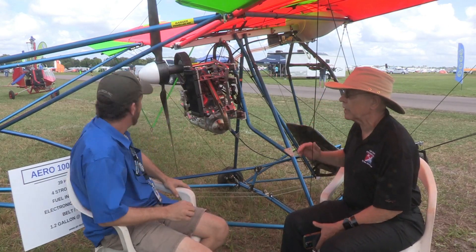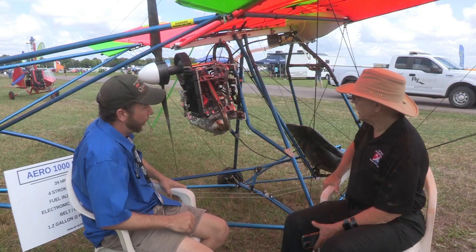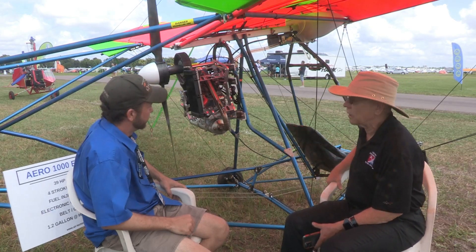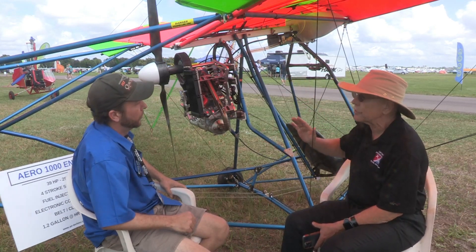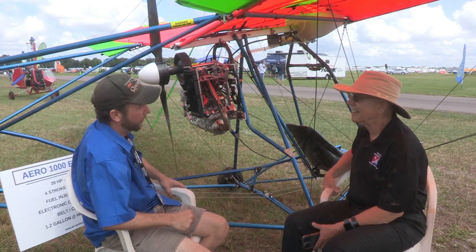What's the prop size? This is a 68-inch diameter. With 40 horsepower and that big a prop on a light 103 airframe, I'm thinking this is going to climb like crazy — maybe not in forward speed but the climb rate will be impressive. Whenever we do initial testing, we're definitely going to have a vertical speed indicator hooked up to verify.